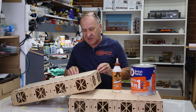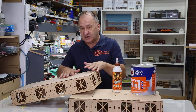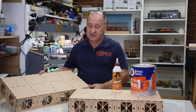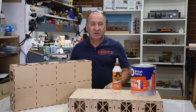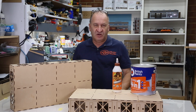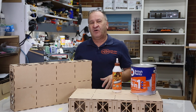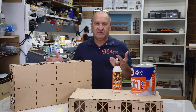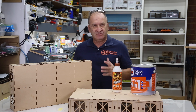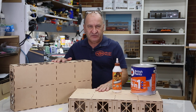The capillary action is such that water will soak past whatever's there, so sealing it in the first place is a good idea. It doesn't really matter whether you're working with MDF, plywood, or any other timber — the better you seal it, the longer your baseboard is going to last. And it's not so much the dollar cost of purchasing your baseboard, it's the time investment. You literally spend hours and hours, so you really want this to last as long as possible.